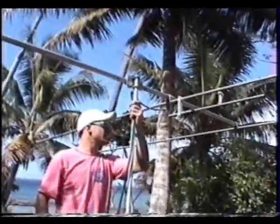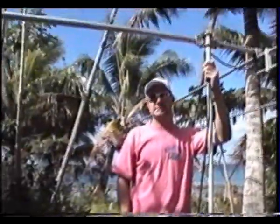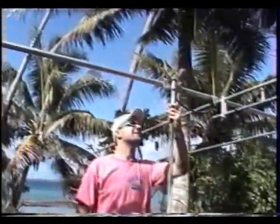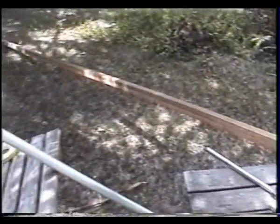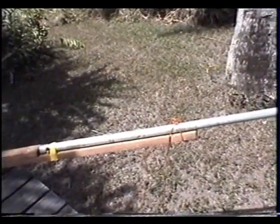Okay, we've just now adjusted the elements on the Yagi. We've gaffer-taped the elements to different sizes — we just done different sizes and resized it to the band again. So we're going to do an SWR test. Alright, we're going back in now. At the moment we're just putting it on a pole — found some coconut tree timber, put them together, put the pole in there. We've just got to get some more materials to join up properly, and we're going to erect it up into this tree here so it goes over the top of the tree.